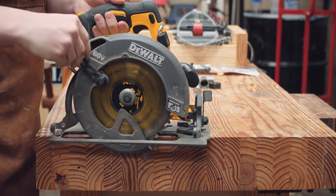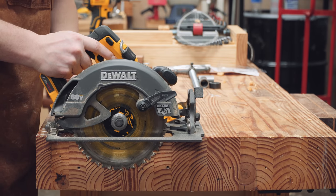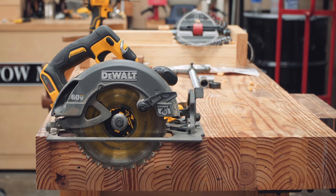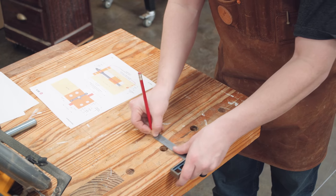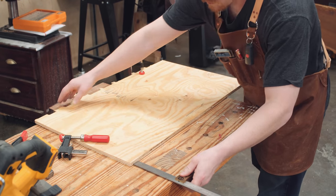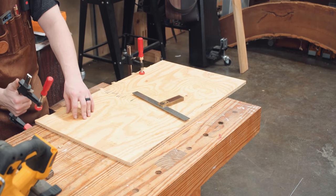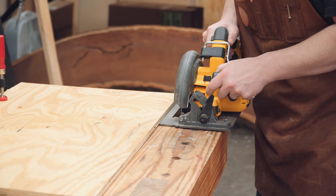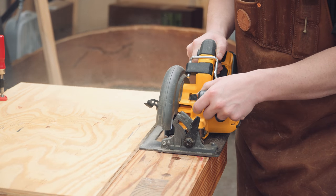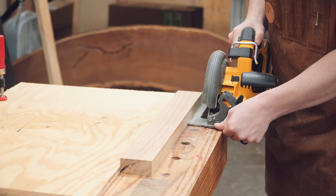To make sure the cut is straight, I'm using a combination of my circular saw and a straight edge. My circular saw does not cut through the entire thickness of the bench, but it will establish a straight reference face to work from. Step one is to lay out the cut on the workbench with pencil, and next a straight edge is clamped to the workbench with the appropriate offset necessary to cut on the layout line. With the saw set to its deepest setting, a cut is made stopping at the end line. Then a spacer block is added and a second cut is made.